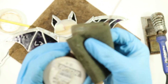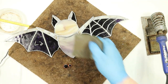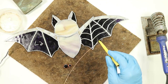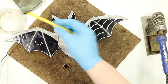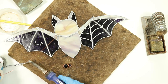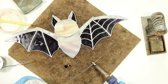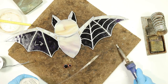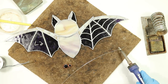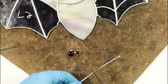Now I'm prepping some copper wire — this is 18 gauge bare copper wire and I'll put a link in the description below if you have trouble finding any. I have another video I'll link here that shows how to do the tinning of the copper wire, which is what I'm doing right now. I cleaned it off with some emery cloth, added flux for the full length of it, and now I'm tinning it. If you're going to tin wire, try to tin it on the spool or at least use a very long length you can hold in pliers — cutting it down to two to three inch pieces first makes it a much more tedious process.